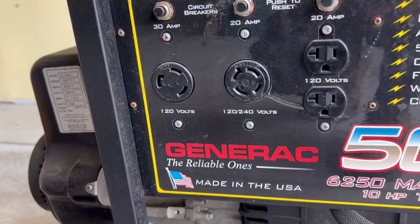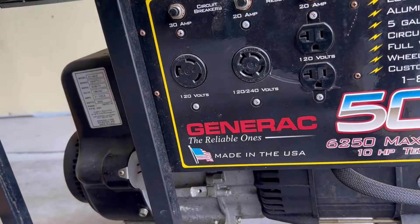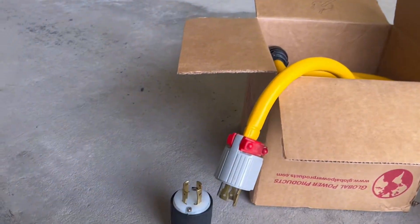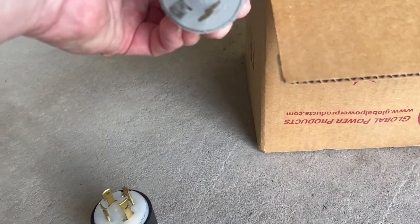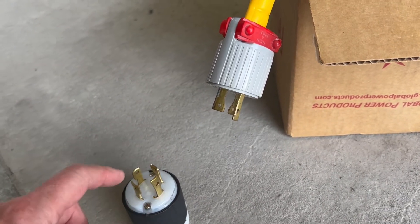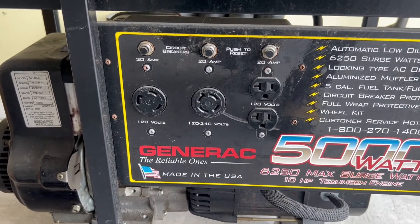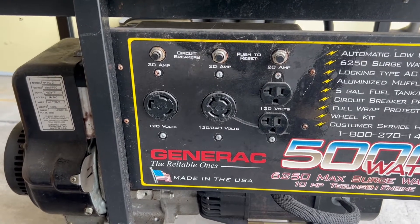The plug on the cable is a 30-amp and it won't fit into a 20-amp. If you had an 8000-watt generator or a slightly bigger one you'd stick with the 30-amp plug, but on my cord I took the 30-amp off and put a 20-amp on. The difference is mostly the radius of the plugs as well as where the locking mechanism is. That's something we can take care of once you order your Generalink — we'll make sure you get the right end to suit your generator.